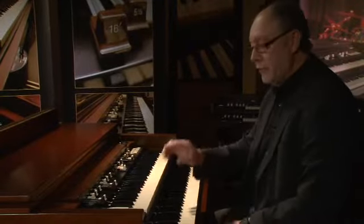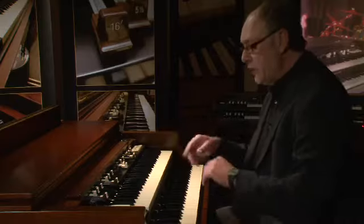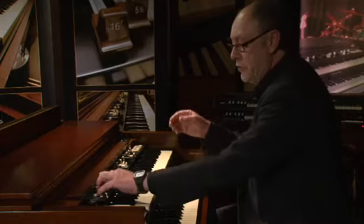The clicking is produced by the contacts being struck, because underneath here there are 9 contacts. In fact, on the new B3 there are 10, because this is also a MIDI instrument. The last contact is a MIDI contact. But as the note is pressed, it produces almost like a discharge, a short circuit if you like, which produces this click sound. Now at the time it was a problem, but in actual fact it's what made this thing become really, really interesting in its tonal texture and colour.